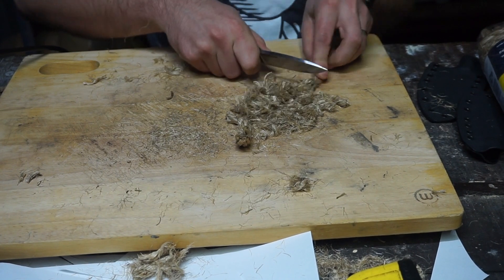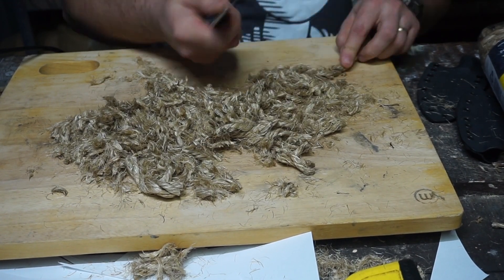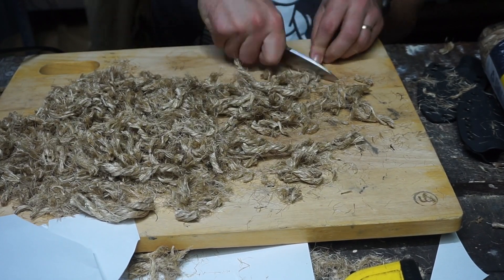So LC200N/Z-Finite did 230. Then I got my Vanax out and did a cut test with the same edge, same rope, same everything. And it cut through the rope 300 times — a very cool baseline result for this steel. Thinking of other steels that have got around that mark: you're looking at S110V, M4, M390 got a little bit more, ZDP got a little bit more, XHP got a little bit less. Definitely up there with the big guns, not the ultra-high-tier super steels like the Maximets, but really impressive for a nitrogen steel and a new steel.